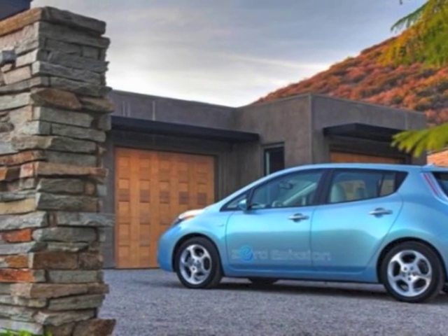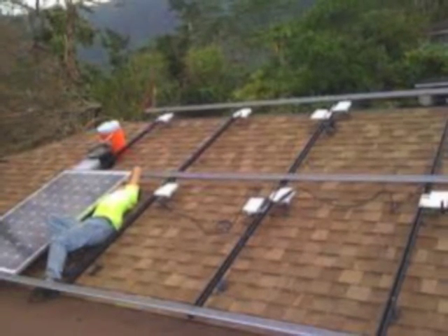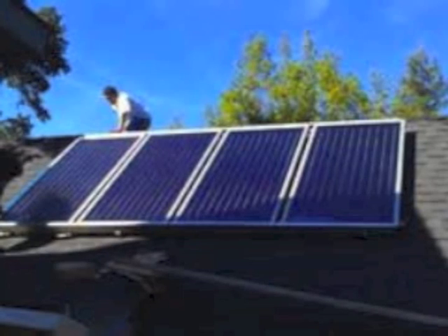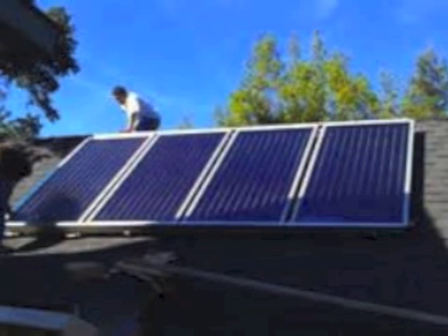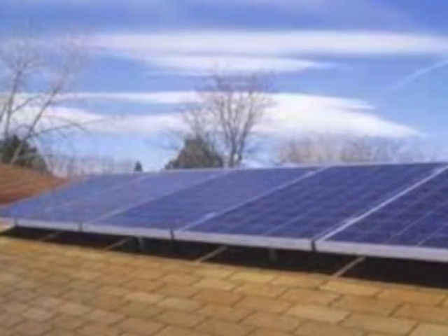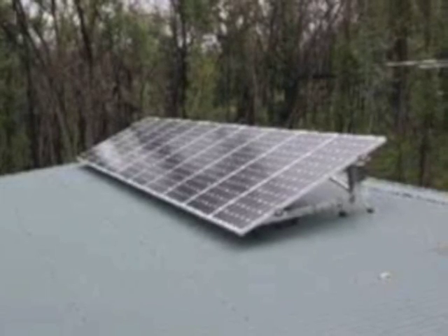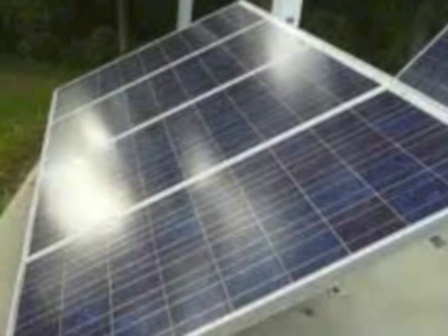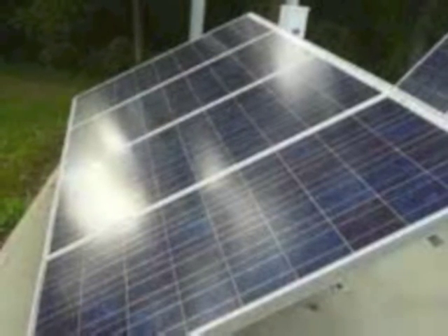It would be nice if you lived in sunny California because that's where you'll get the best sun. You usually find a good place to mount panels on your roof on these racks, but they must be well away from shady trees or roof structures that cause shade. You need a nice, well-lit, solar south-facing surface. You can mount them on a flat roof or tilted roof, and the racks help you adjust the tilt angle for best solar capturing in your neck of the woods, north or south.